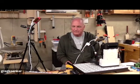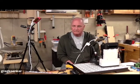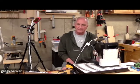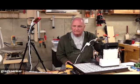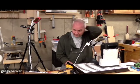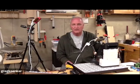But yeah, the other thing that I really enjoy about it is that when you scan your piece, you can see the grain. So if you're going to cut something for an inlay, or even sometimes you want your leg to follow the straight grain of the wood a little better, whatever piece you're making, you can rotate the drawing to go right along the grain, and you have a lot more choice as to how you want it to match the grain. You can actually see what it's going to look like with the grain there. I really enjoy that part of it too.